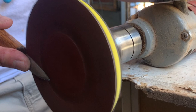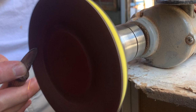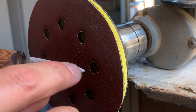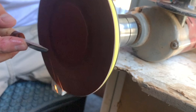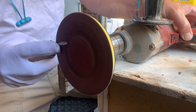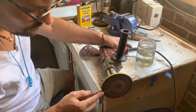Here I'm showing light reflections on the blade — a great way to see if you have a burr going; you'll see a little hairline reflection near the edge. You can also see if your bevel is one flat unit versus a bunch of different planes reflecting as you rotate. Again, you're seeing some sparks but that's because we're watching in slow motion up close. Really watch that temperature. I'm starting to put gloves on because you'll get a lot of black steel dust, and if that gets on your polished wood it'll be hard to get off — you'll have to start polishing from a lower grit again.